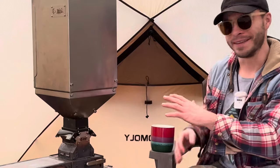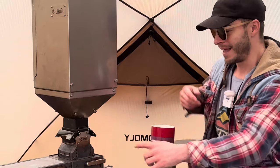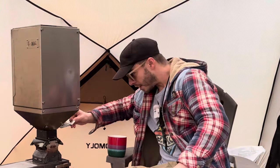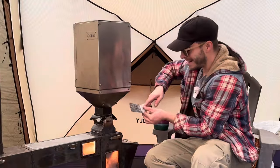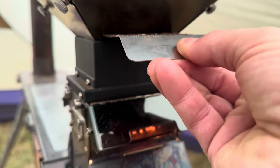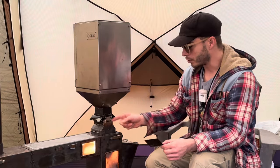You can close this right down. This is the first wood stove I've ever seen that you can shut off. If you close these two doors and then grab this piece right here — it slides in. I have it oriented on this side because when you try to put it in over here, it gets really hot. When it slides in, it closes this off, which stops pellets from falling down into the burner. With the doors closed and this in, you can shut this stove off.